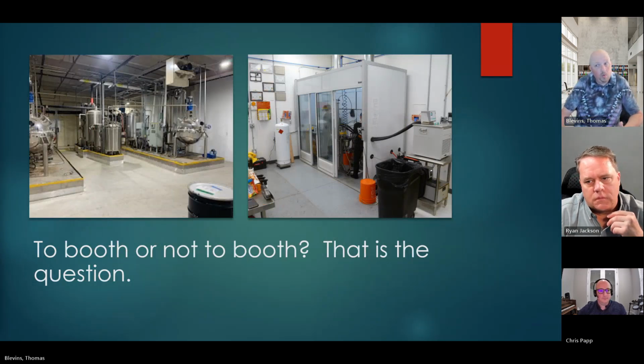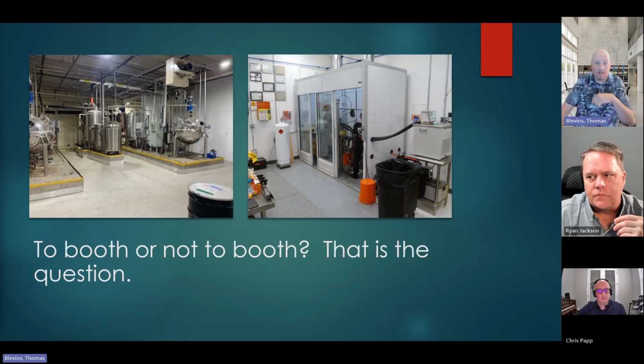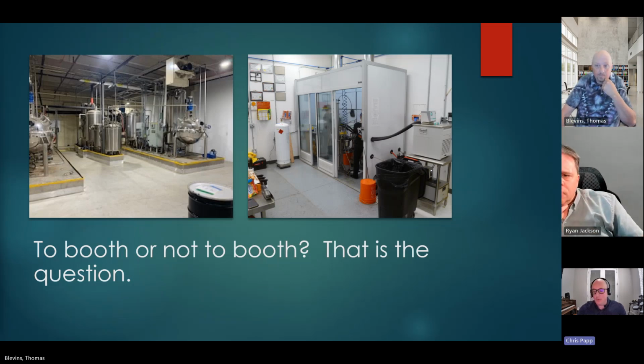And so now that you know these three different types of processes or post processes, it brings up another good point. What do we do, Chris? Well, so we're going to bring part 2 of Article 512 in, which begins at .3 section, and it covers determining area classifications. There are 2 basic parts, whether the equipment's in a booth or not in a booth. So it begins with equipment not in a booth, and that's what Tom touched on.